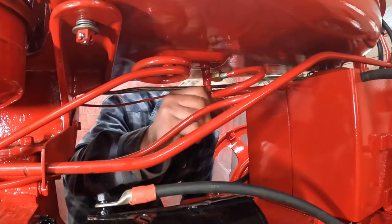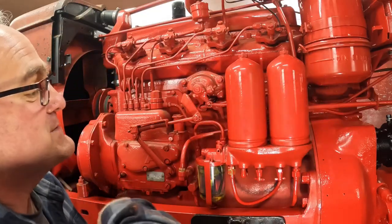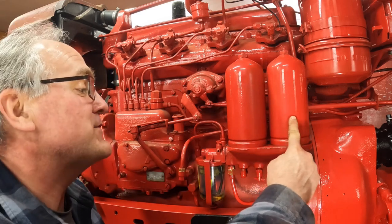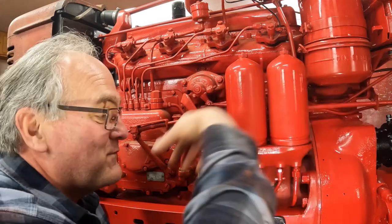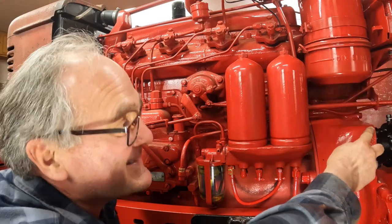Open up the tank valve and let the diesel flow. Now then, next step, you remember all this mess. We've got the auxiliary filter, which some people would call primary filter. Then we've got the final filter here, water trap, injection pump, and the circulation of the diesel is a lot more complicated than it is with modern.